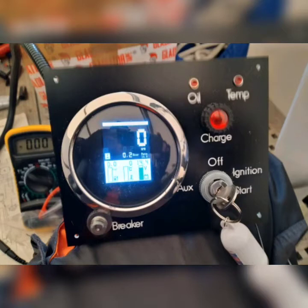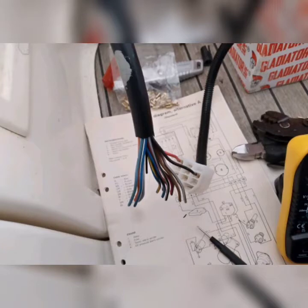So, time to move on. Our next move is to use the wiring diagram that has been supplied by the owner, showing the original wiring for the Volvo Penta engine and the new wiring diagram supplied by Dragon Marine Systems, to marry up the original functions that were on the panel. Once more, taking one wire at a time and connecting one wire at a time and testing one wire at a time. You may be able to see from this photograph that the panel is still active.